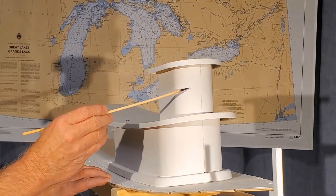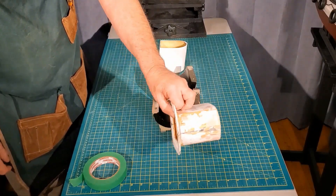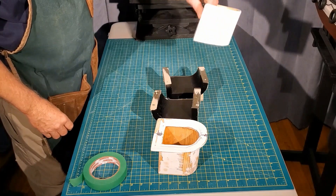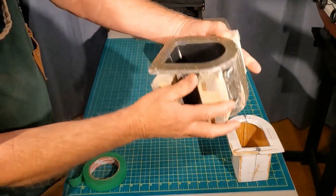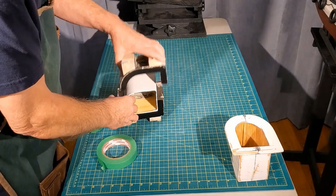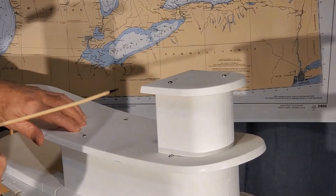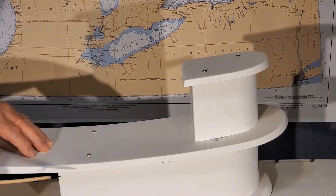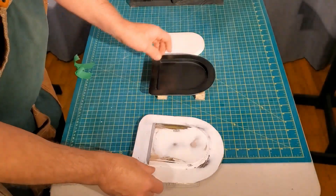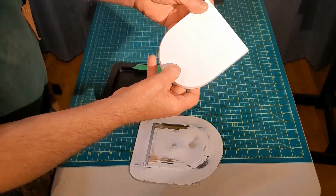The next fiberglass part is the pilot house, and it is screwed onto the roof. Here's the pilot house plug, the two-piece molds, and a fiberglass pilot house. They fit together with quarter-20 bolts and nuts. I use a tape border as a boundary for my gel coat and resin — it's very light and strong. Up on top of the pilot house we have the pilot house roof, which is screwed onto the top. Here's the pilot house roof plug. Once again I have a flange here; it's just a simple one-part mold. The tape is applied, and here's the pilot house roof.